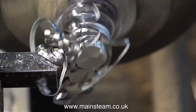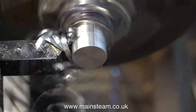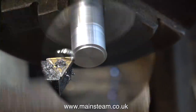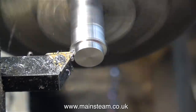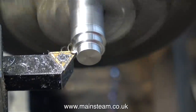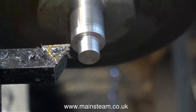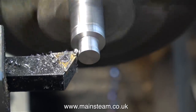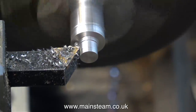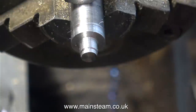This is a dangerous situation, because if this swarf catches in the chuck jaws, what's going to happen is it will suddenly fly around, and if you're stood in line with the chuck, you're very likely to be hit by some of it. I speak from experience, and I must say that it's a painful experience. Whenever I'm turning bar stock like you've just been watching, I always stand to the right-hand side of the chuck, out of the line of fire. With a suitable piece of steel in the chuck, which is half an inch in diameter, I'm now going to start making the buffers. This involves turning the steel bar down to 4.8 millimetres so that the buffer will fit into the buffer stock.